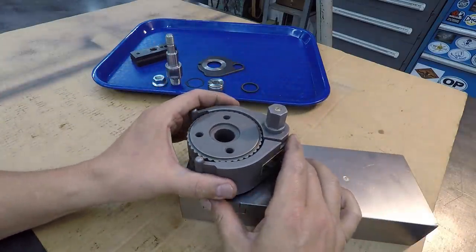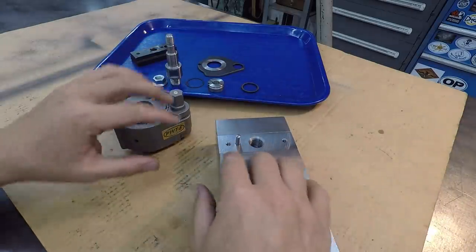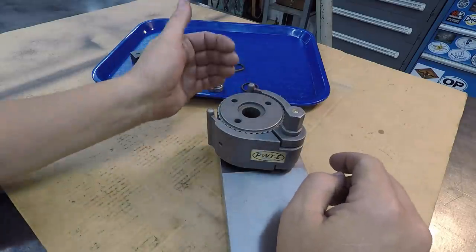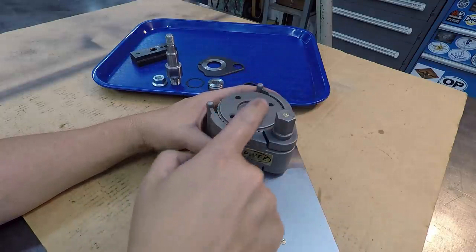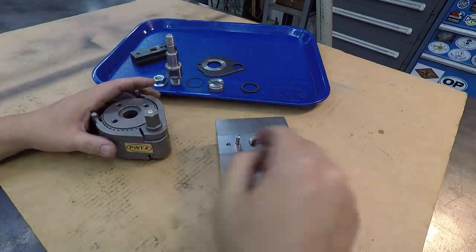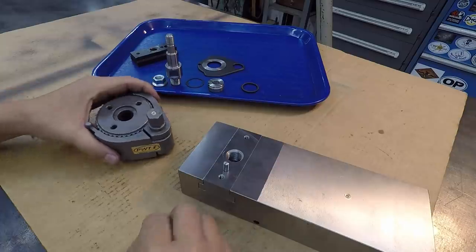I think that really what you have to do is get this set up on the lathe where you want it, bolt it in there, mount your tool post where you want it, get it mounted, get it indicated. I always indicate the face of my tool blocks to make sure they're perfectly aligned. And then once that's indicated and this is tight, you could simply transfer punch one of these hole locations somewhere. You can just line it up on this side if this one's not working. Just go over here, transfer punch the hole location and drill it yourself. So Joseph could possibly do that. You just need a 6mm drill and a transfer punch to do that. So I wanted to mention that as well.